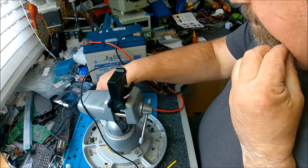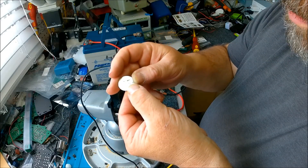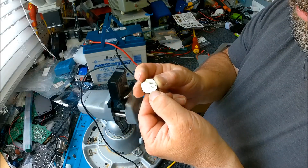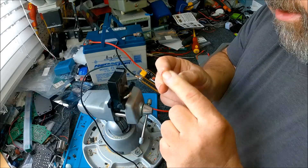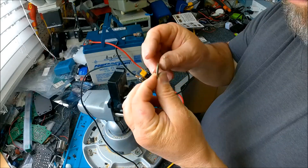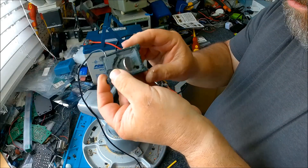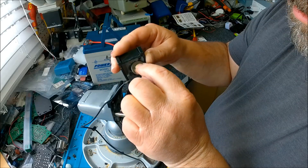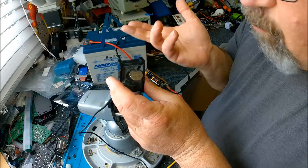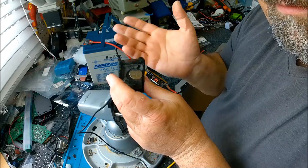This was the original battery - it's a CR2325, a 3-volt lithium at 160 milliamp hours. I don't have a CR2325, so I decided to put in a really common CR2032 - same voltage but with about 240 milliamp hours, so it actually has more power. It's a little bit thicker. Not sure why they used that particular battery - probably just what they had on hand.